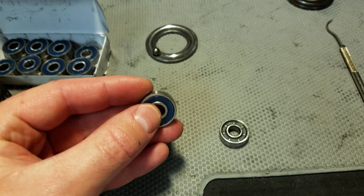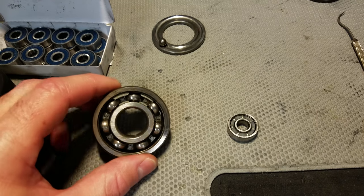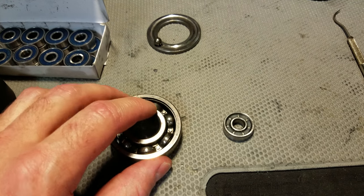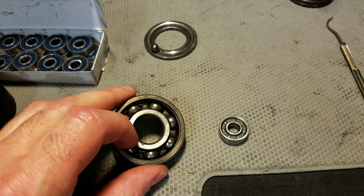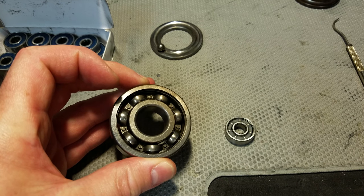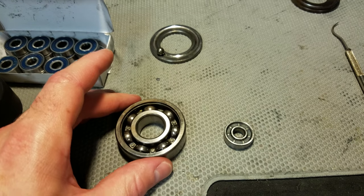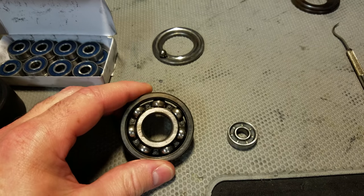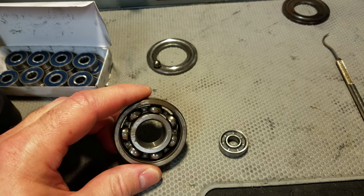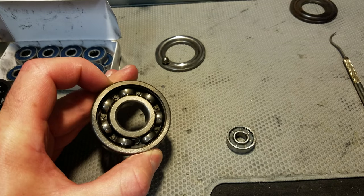Occasionally you will also see fiberglass-reinforced nylon. The metallic one on the left here is called a ribbon bearing — it kind of resembles a ribbon when you look at it. It's actually two parts that are stamped together, and you can see little studs that go around the balls and retain them. They're sturdier, but the drawback is it's steel on steel — you have more friction and more noise. Noise equals harmonics, and harmonics can be a problem, so for low-speed bearings steel ribbon bearings are more than fine, and it's also a way to cut costs.